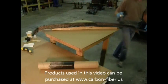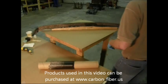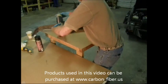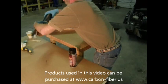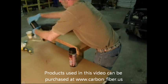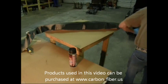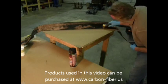We went ahead and did a second layer of fabric over the whole thing. Just spray another layer of the spray adhesive and repeat the process. Unroll the fabric, turn at the end just like the first layer, let it drape gently down and press it into place. Then once you get done, trim off the excess.